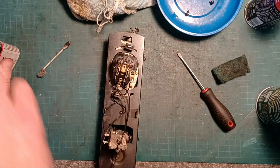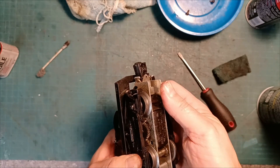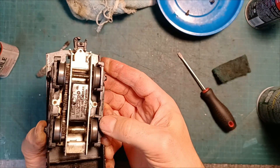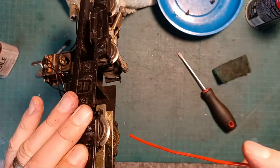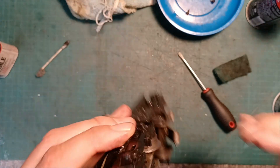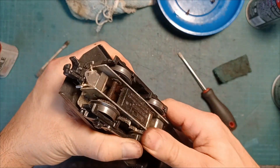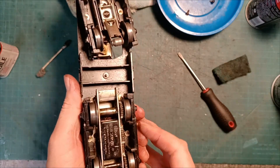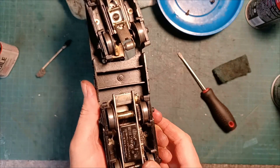The motor is clean and back together. I'm not worried about this motor at all, and we've got plenty of lubricant down on these wheels. With the motor in, there's a little more resistance, but it's definitely moving a lot freer than when we first opened it up. I'm going to hit these with some more penetrating oil and let that soak in real good, also working it in with my hands. It seems to get hung up at one spot, but the gears all looked fine — there's no missing teeth — so I'm not sure what's up with that.